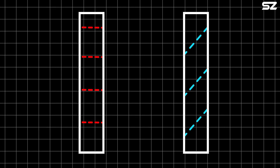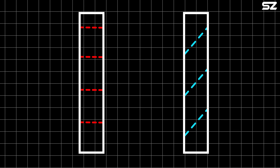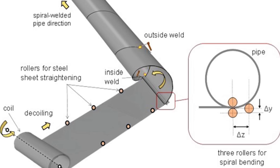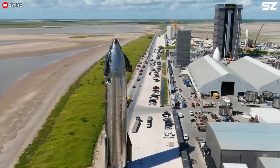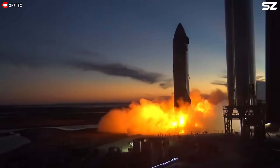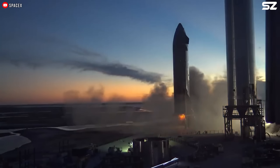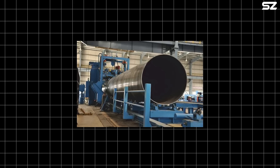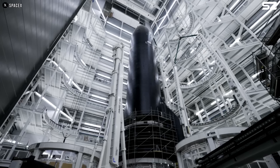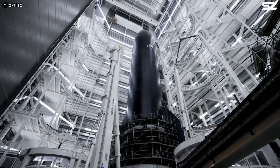One advantage of spiral welding is its ability to reduce total weld length by utilizing the perimeter of the roll, minimizing welds compared to cutting the roll into rings. It also addresses a key vulnerability in traditional ring construction — the scalp weld. In pressurized cylinders, circumferential wall tension is greater than axial tension, placing maximum stress on the scalp weld. By eliminating this weak point, spiral welding may allow for a reduction in material thickness and rocket mass. An automated spiral welding process would enable full automation including post-weld inspection, corrective welding, and cutting material into pre-selected, optimized lengths.